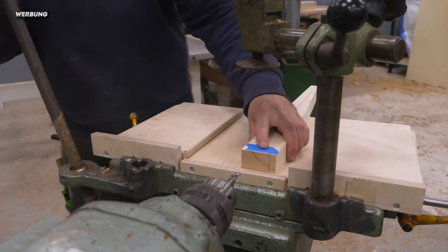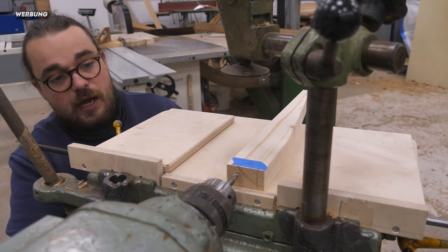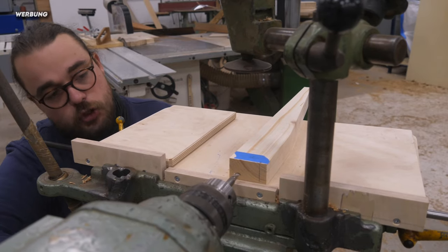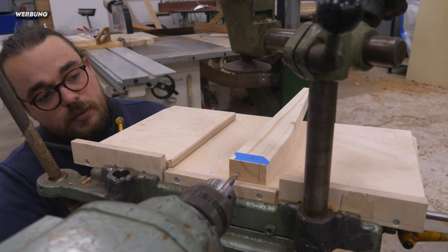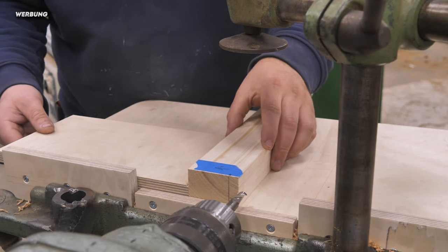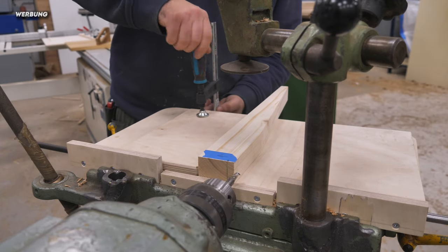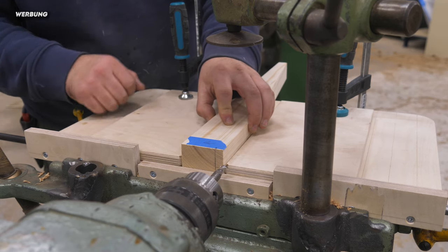And first I'll adjust the height on the slotted hole machine. That's not so important now, because we'll just adjust the reference edge from below on the vertical. That means it doesn't have to be exactly in the middle, it just has to be roughly in the middle so that it can accommodate the stability better. Then I'll bring my stops over here. I'll attach them straight away. Now I can simply push my cantilever arm in here, clamp it in place and mill.